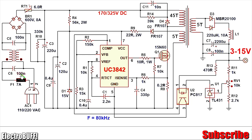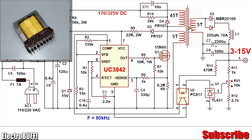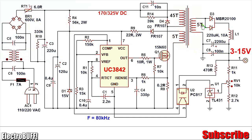Capacitors C5 and C6 are rated for 100 nanofarads and at least 400 volts AC. Ensure the differential inductor can handle at least 5 amperes. For the transformer, it's a high-frequency ferrite power transformer and the core area should be at least 1.4 centimeters squared to handle 150 watts. The primary turns are 45; the auxiliary and secondary are 5 turns each. For the primary winding, use enameled copper wire of AWG 25 — rated for 85 kHz and can handle about 2.7 amperes — so parallel two strands to safely handle 5 amperes. The auxiliary winding uses AWG 25 with a single strand; for the output winding, which handles nearly 10 amperes, parallel at least four strands together.